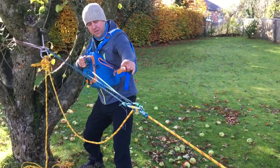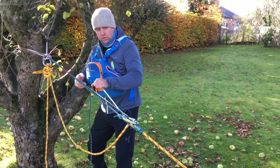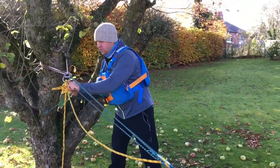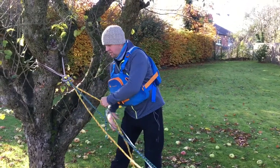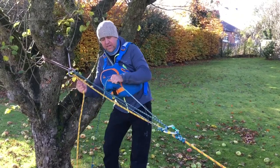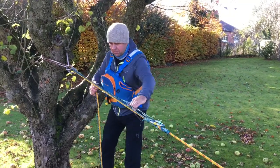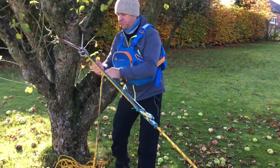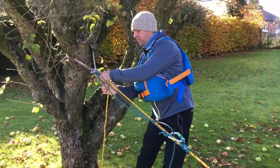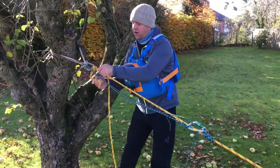And the boat is being pulled out and this slack is being generated. And if I were to let go, chances are that would all go tight again. So what I need to be able to do is pull the mechanical advantage, and with some help the person takes in on the hitch. Pull, hitch. Pull, hitch, pull, hitch. And when I've got that as tight as possible, and if I can't get any more mechanical advantage out of it, I can lock it off.